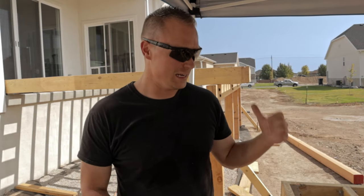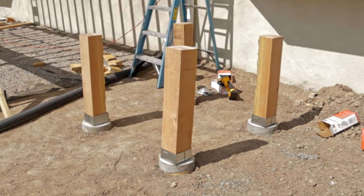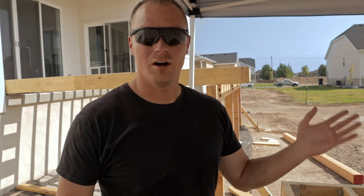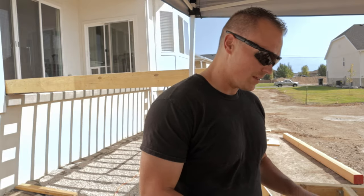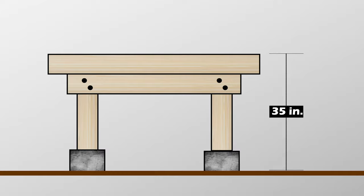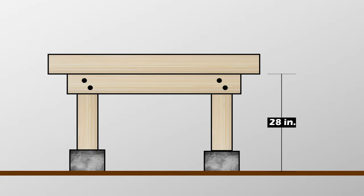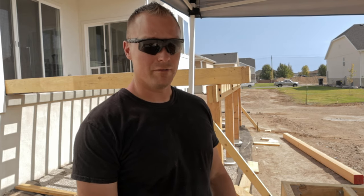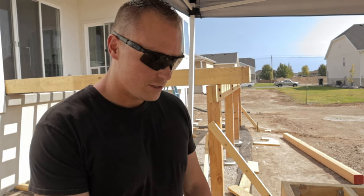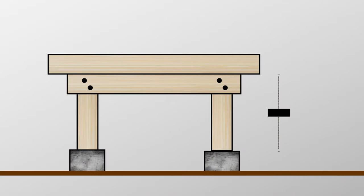When I put this landing in I'm using six-by-sixes, just like over here. They look chunky — it's what me and my wife like. They're expensive, so I'm not going to over-measure and waste material or money. I know that from the ground to the top of that platform is 35 inches. Subtract the platform's seven inches and you're sitting at 28 inches. My piers are sitting about two inches above the ground, so subtracting two more inches puts me down to about 26 inches. I'm going to cut at 27 inches just to have a little extra.